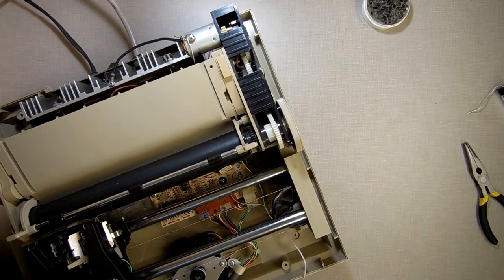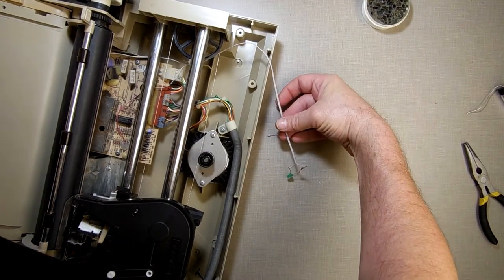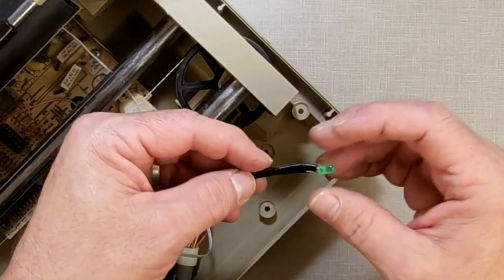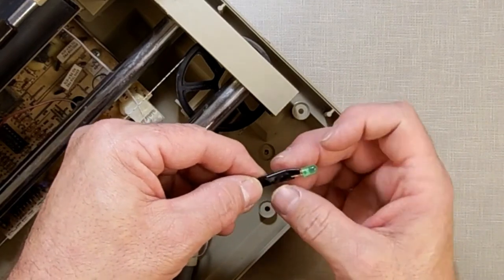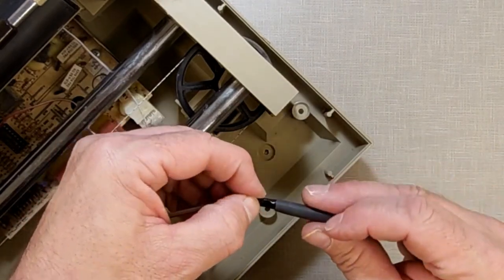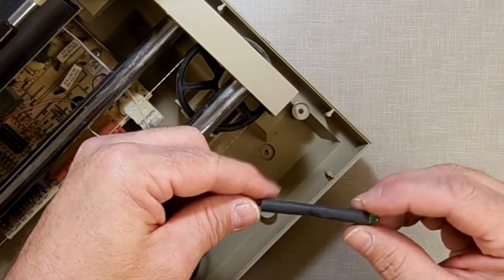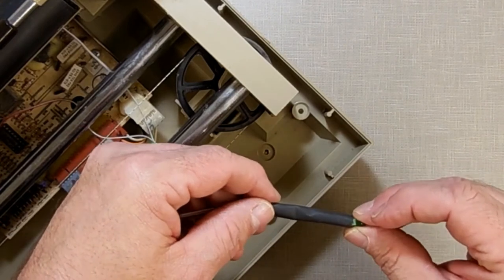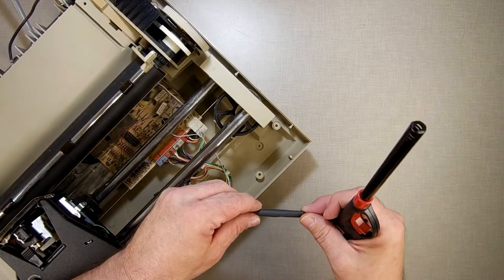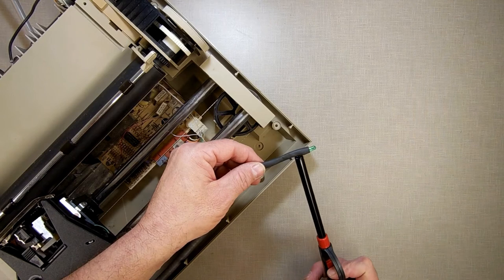Now I'm going to isolate these wires so that we don't get any kind of shorting, then mount it and go from there. I took some black tape and wrapped it around one side, and after that was completely covered I went around the other side. Then I'll take some shrink tube and put it over the whole thing, and use my little barbecue starter to shrink the tubing down to hold it in place.